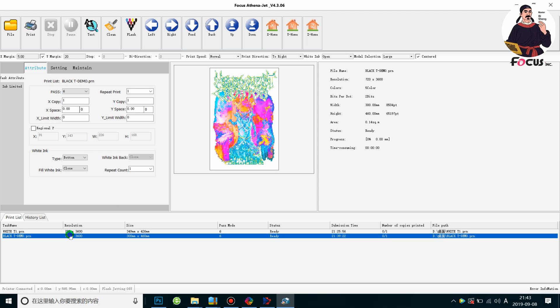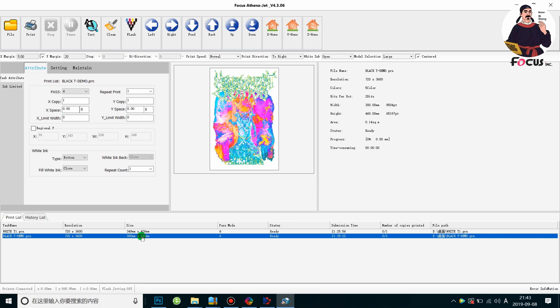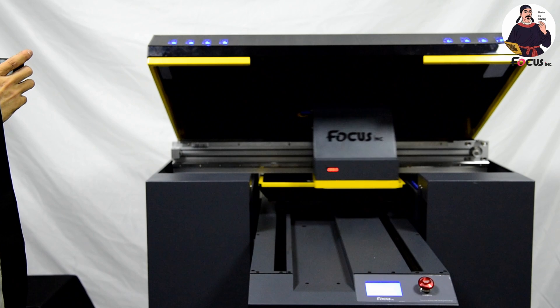We choose the file and go to print. Before you click on print, you must be sure the gap between the t-shirt and print head is safe — the distance between the t-shirt and the print head surface is 2 to 3 millimeters. No scratched print head at any position, otherwise the print head will get damaged and be a big risk for you. Also be sure nothing stays on the surface of the t-shirt to avoid print damage. After you are sure all the settings are okay and the print machine is ready, and the black t-shirt has the pretreatment and heating press ready, we go to right-click, print.